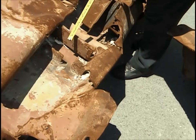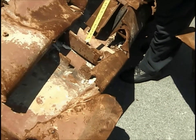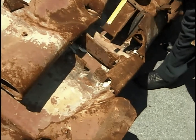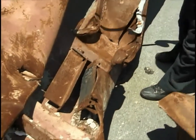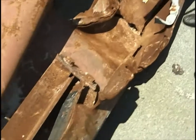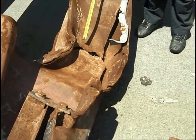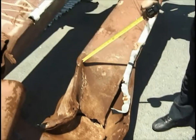The seat, step, or shelf of the floor is here, as is this gusset up above, which is usually missing. The damper plates are intact but bent over. There is a collapse of the box here, possibly with a little bit of enhanced corrosion. These are cracks in the welds.